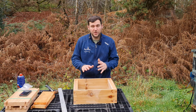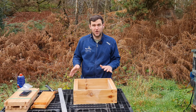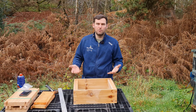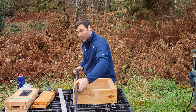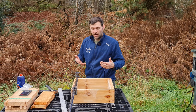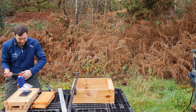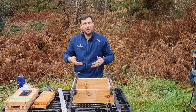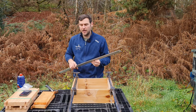Once it's perfectly square — 648 millimetres both ways — you can stick a clamp on it. I use straightforward sash clamps. Ideally you need four clamps, one at the top and one at the bottom on each side. All I do is put one clamp on, tighten it up, add another, tighten it up, flip it over, do the same, and make sure it's all tight. Most important — double check that the diagonal distances are exactly the same. Then just let it set.